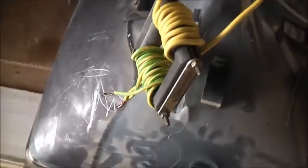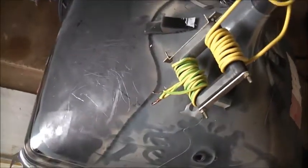I've decided to use its own winding here — round, around, around, joined up and round back around its own winding. Let's see if this actually works out this way. I might have to cut it short yet and make my own separate coil and join it, but we'll see how it goes. What I'm looking for is to distribute the heat through it and inductively heat it — cook some cathodes in the process. Rejuvenate the CRT the lazy way.